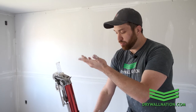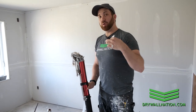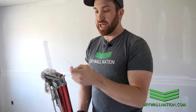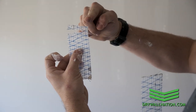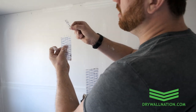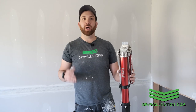I also want to mention that when you go to cut your tape, you want to come to a complete stop with your taper. When you pull down to cut and let go, it automatically returns to the neutral position — so if you're still rolling while cutting, you'll essentially do a double cut on your tape. That's how you end up with tape jams: the blade cuts one way on top, then as you keep moving the blade comes back in the opposite direction and doesn't fully cut through. That would end up jamming your taper head. So it's important to come to a complete stop before cutting your tape. I hope this quick video helped — for more tips and tricks, make sure to check out our other educational videos with Level 5 Tools.